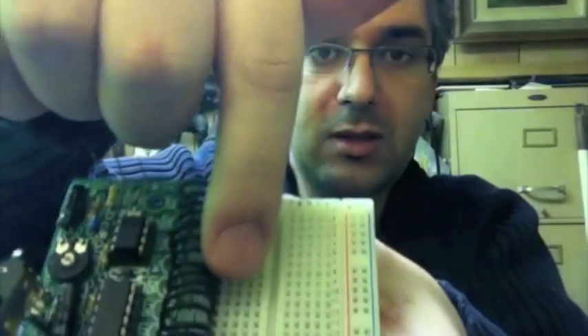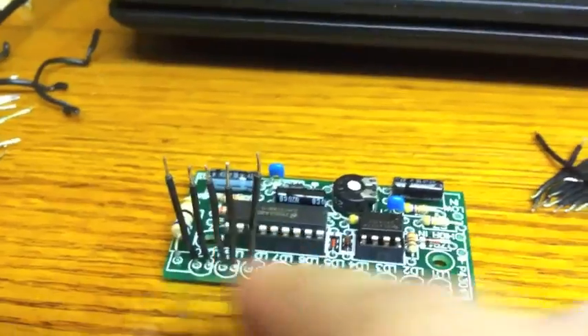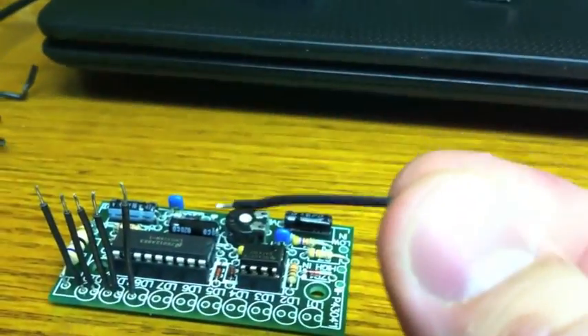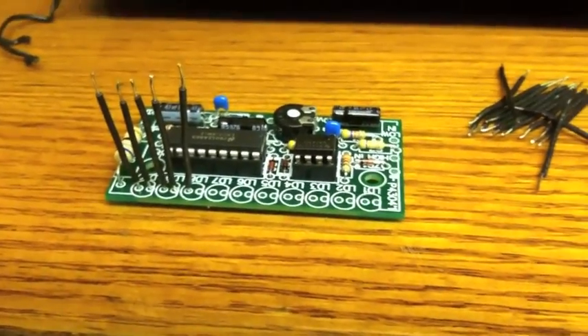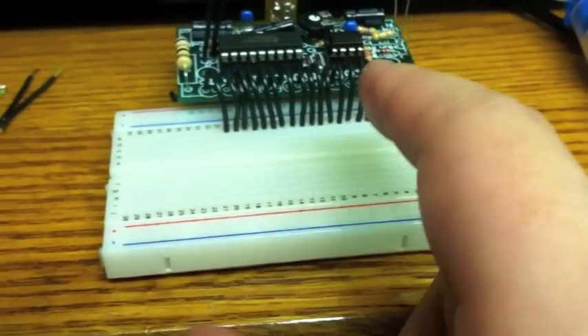This is just a breadboard for now. You can see I cut out all of these little wires where the LEDs are supposed to go and put them into the breadboard. Then I can plug my LEDs into the breadboard and get the configuration I want. I have the second board assembled and I cut about 20 of these little wires from a big spool. I've got to strip them on both ends, solder them in place, attach them to the breadboard, and then we're good. I stripped them all lovingly and I'm putting them in where the LEDs go, and then the stereo module thing will be done.